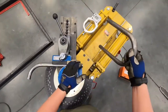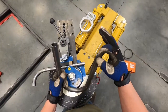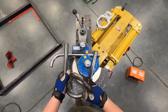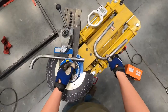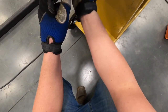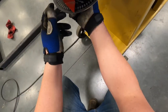If we want to make a 45-degree bend, because metal has memory and will spring back, we need to go past the point we actually need. From experience with .083 tubing — that's the wall thickness — we have to bend six degrees past where we want the achieved bend to be. So for a 45-degree result, we set the tube bender to 51 degrees. We have an auto-stop dial here with a thimble bolt on the bottom and a ball bearing that rides on the edge of this plate.